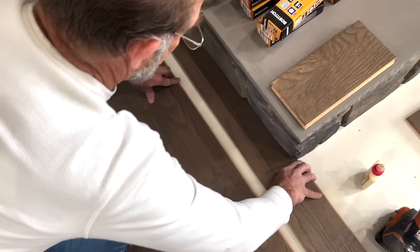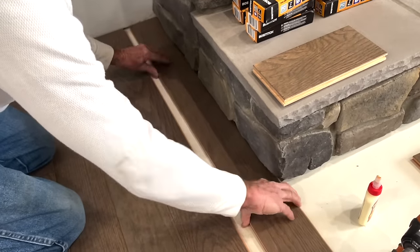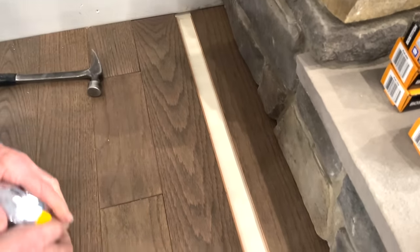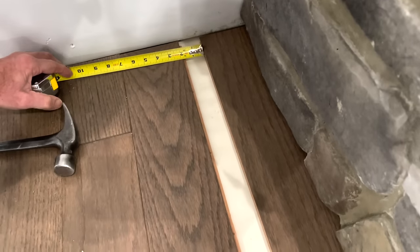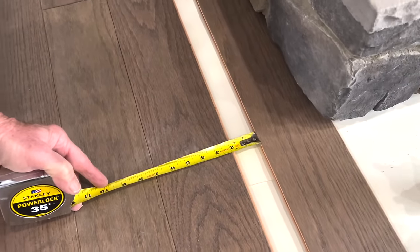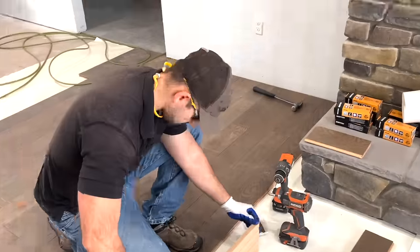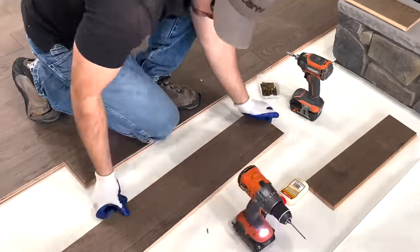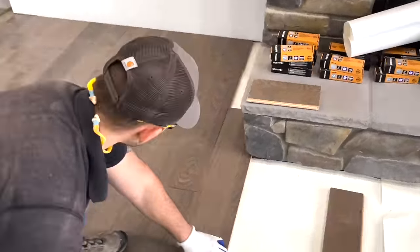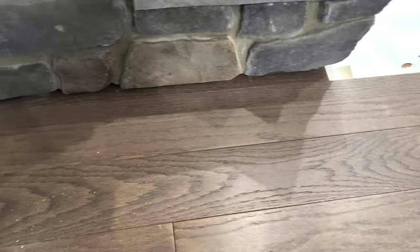Here's an interesting situation — once we got up to the fireplace we needed just a small strip to slide underneath the stone, but there really was no good way to secure it and you can easily see up under the stone. So we got the measurement of the piece needed to finish up the run by holding it underneath the stone and measuring that way. We ripped down the piece and secured it to that piece of hardwood floor before installing it using glue and screws. Then we slid it back into place, used the pry bar to pry it into position, face-screwed the piece down, and it turned out really nice.